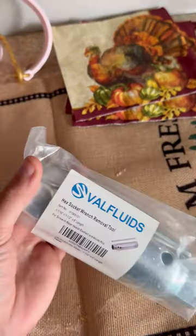Good morning, welcome to another episode of Farmhouse Fix-Up. What a lot of people won't talk about when owning an older farmhouse or farm property is that stuff hasn't been replaced since it was built. Turned on the water this morning, took a shower — five minutes maximum hot water. That's telling me that one of the elements in the hot water heater went out. Time to replace it — that's what we're doing today.